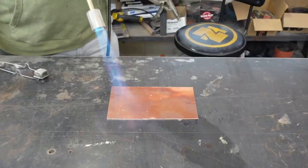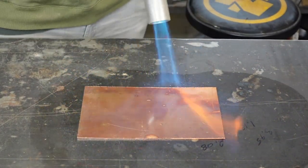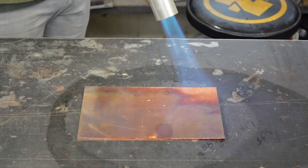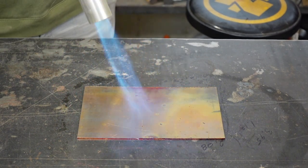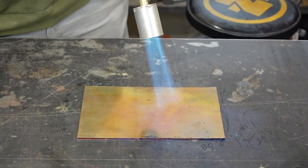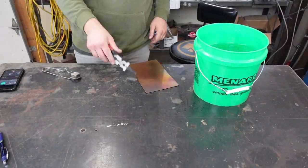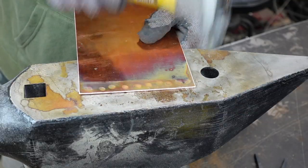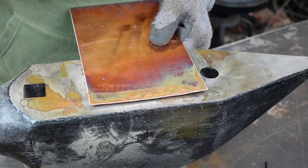So I've got my blank out for the lid right now and this is half hard material. What I'm doing here is taking the torch and I need to anneal it to soften it up to make the hammering easier. That color right there is what you're looking for — when it gets to that color you know that it's been annealed. You can go ahead and soak it straight in water and it won't harden it or anything. So now I'm going to go ahead and start hammering over an anvil to get the hammer marks.